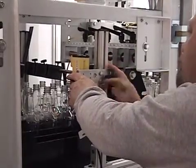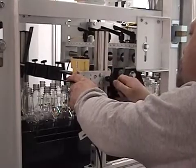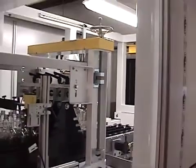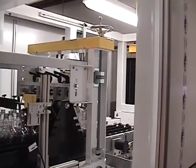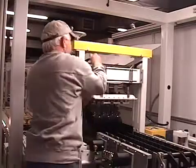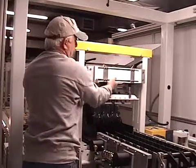However, the overhead line brake requires a 1/2-inch wrench for adjustment. An Acme threaded rod with a crank adjust unit is located on the line brake for height adjustment. The line brake is mounted on Thompson bearings and shafts and allows for in and out adjustments for centering purposes.